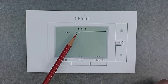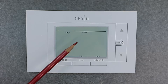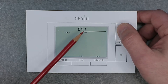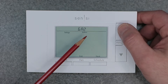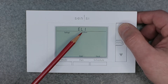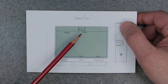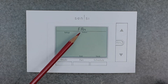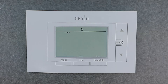Next is the indoor equipment configuration. I have it set to fan, and most likely you will too. The other options are GA1 for gas one-stage, GA2 for gas two-stage, and electric heat one-stage or two-stage — same principle where one or two refers to the number of stages. I'm going to leave it on fan since that's what operates the indoor fan.